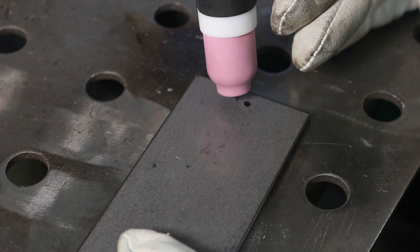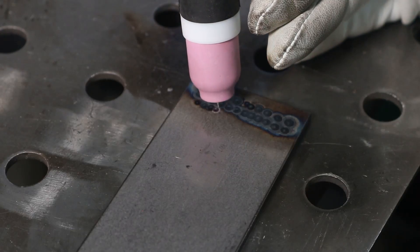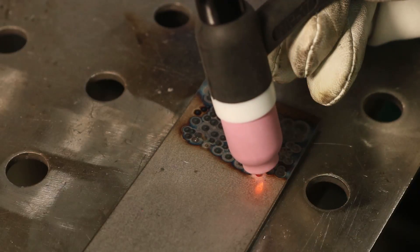It's good and consistent — that was running about 120 amps on that fillet weld. I'm just running a flat bead on plate just to get a little more arc time and see the machine run. Now you saw how we had to touch the electrode to the steel to get it to strike an arc, and I just want to make sure that the high frequency arc starting here was pretty good. So I decided, what better test than to just strike up the arc a hundred times. Out of that whole hundred times, I think only twice did I have to touch the electrode. I had an old Miller welder that would do the same thing — it's really not uncommon and not something specific to this machine, but just a tip if you have issues with that when you get the machine.